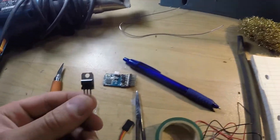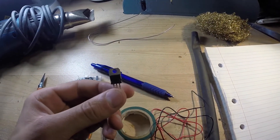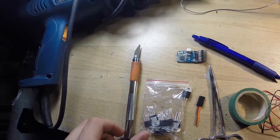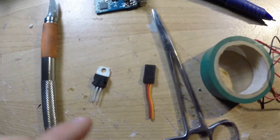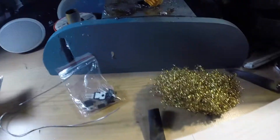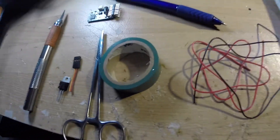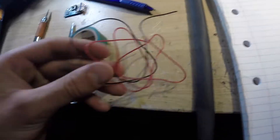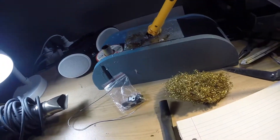In this video I'm going to show you how to use an LM7805 for low current devices and remote control systems. You're going to need a hobby knife, an LM7805 (you can buy them on eBay in packs of ten for about two bucks), a servo wire, and some miscellaneous wire. You can use heat shrink or tape — heat shrink is a lot better.